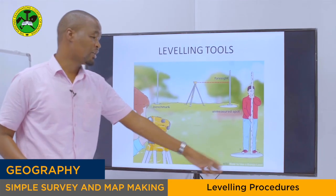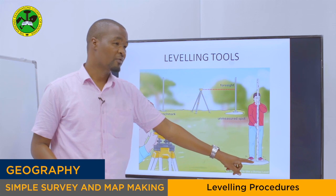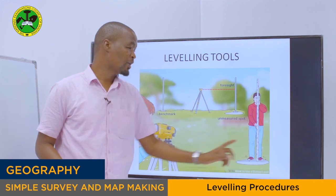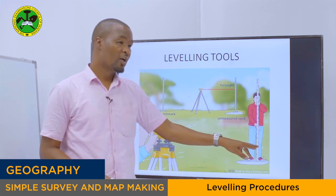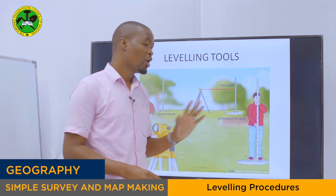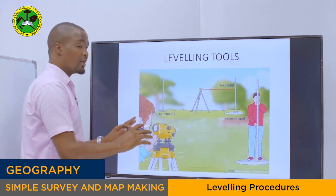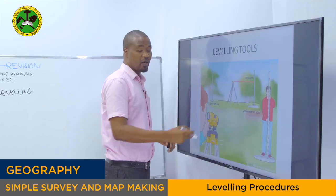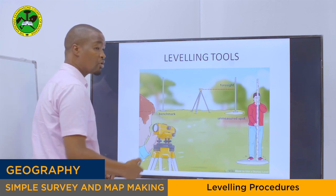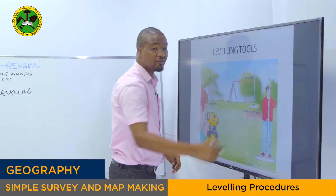We have what we call the leveling staff. As you can see, this man is standing holding the leveling staff. It is a metal-made staff of either 4 meters to 4.5 meters long, colored and graduated at equal intervals in either millimeter, centimeter, or feet. This we call the leveling staff. We have the other instrument called the spirit level. For instance, this one, as you can see right here, it can be either the Dumpy level or the theodolite. This is what we call the leveling instrument, and we have the leveling staff over there.